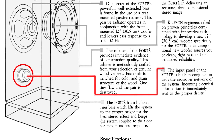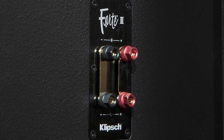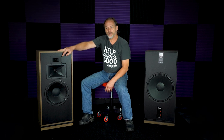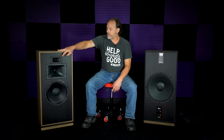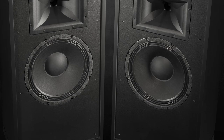On the original speaker, the input cup was inset and had the five-way binding post. The second gen had a different input cup with the same basic five-way binding post. On this unit we have a flat metal plate instead of the inset cup — it's a more rugged binding post and easier to get to and make connections. On the earlier generations of the Forte, the original tweeter diaphragm was phenolic, then poly on the second gen, and titanium on the third. The same progression happened on the mid-range. The woofer has always been a hemp-based woofer — they've changed manufacturers and adjusted the cone weight slightly over the years, but for all general purposes it's pretty similar, with some acoustic values being a little different today, enabling a slightly different voicing of the speaker.